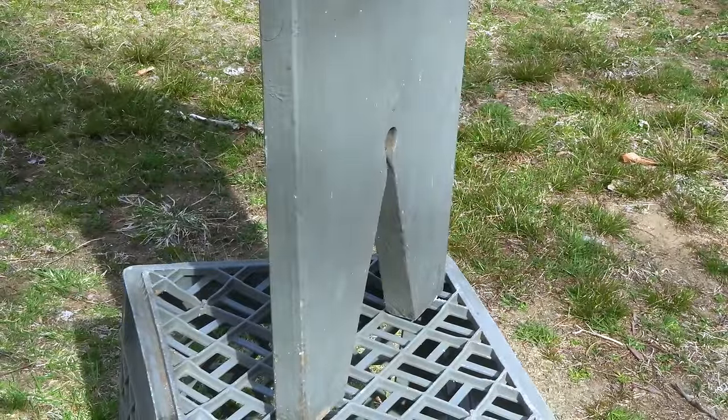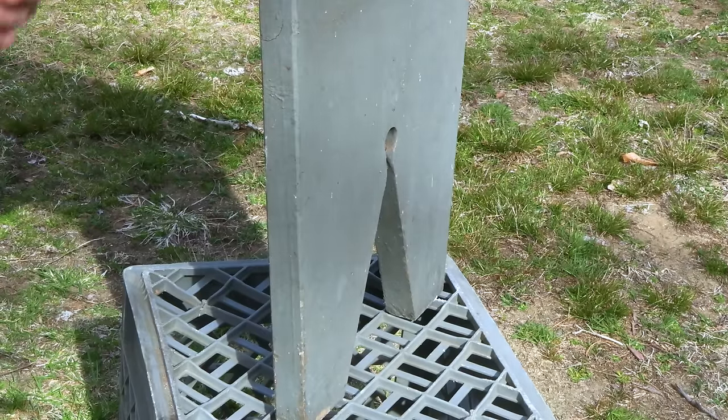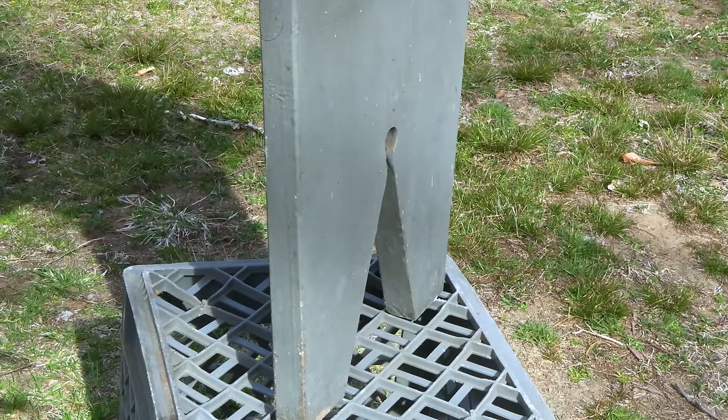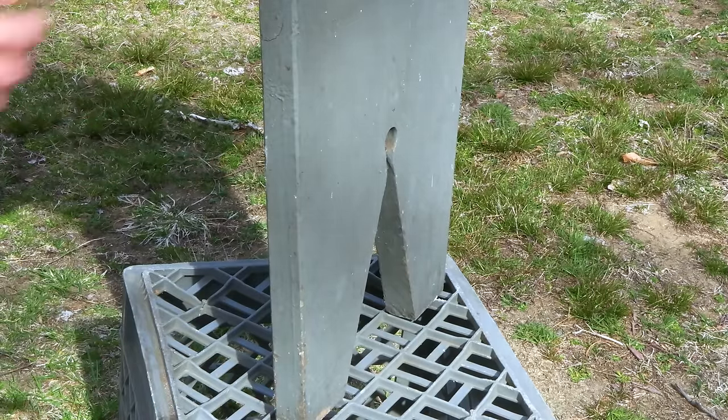This wouldn't be Furniture Forensics if we didn't geek out over some tool marks. There's a long line running all the way up this leg — I can feel it, it's a little hump. During the build, the carpenter hit a nail with his jack plane, leaving a big notch in the blade, and you can see that notch telegraphed here. It's on the other leg and all along the front, but only on about half the pieces. I think he got halfway done, hit a nail, looked at it and said, 'screw it — I want it to be nice, but it doesn't have to be that nice.' It's happened to me too. I usually take that nick out, but I'm not getting paid by the hour.